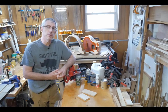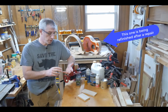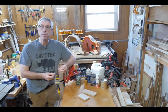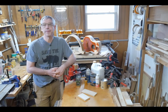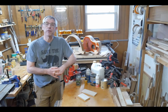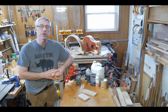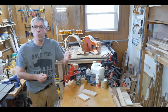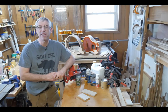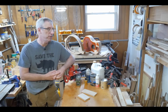So the next reason is to make a guitar look good. Well, that's pretty important. Guitars look good sometimes when they're tinted different colors or painted. And a lot of times people like that real shiny, almost wet look finish. I prefer a little bit more of a satin finish on it, and that's okay too. In fact, on the neck, sometimes you'll put a different surface finish than on the rest of the body because your hand doesn't always like feeling that real slick, wet look, gloss finish. Oil often works better on a neck, or something at least feels like oil. So those are pretty good reasons why you'd use different materials.